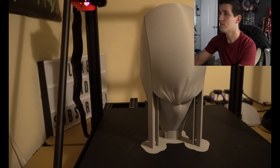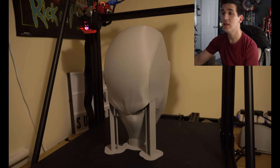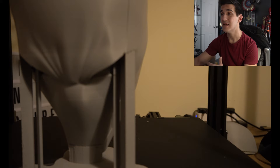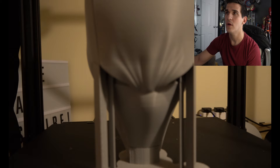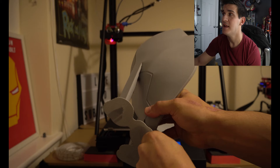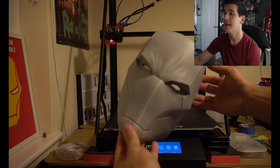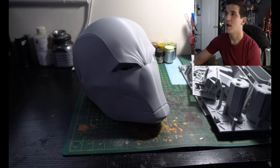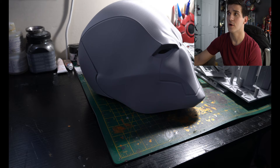You can see here how it printed exactly how I just had it oriented. I believe I made the raft a little bit bigger, so it was able to go down there and touch the actual print. It printed very nicely — I forgot I printed this on my CR-10 Max, not my CR-10S, but it took about the same time. You can see it survived just fine. It had a little bit of wobble but it wasn't too bad. The layer lines and everything sanded out just perfectly. This was printed in gray Monoprice PLA Plus at 215°C on the nozzle and 60°C on the bed. The supports and everything were breaking away absolutely effortlessly, and I was able to peel it off the chin — that was the only outer collision area. So it was able to be cleaned up really easily.